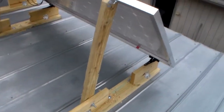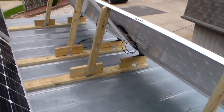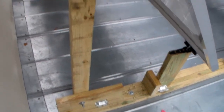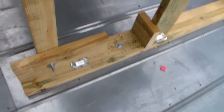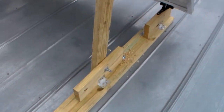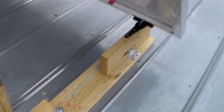I kind of like working with wood. I don't mind working with metal, but I thought I'd make these mounts out of wolmanized 2x6s and some 2x4s, and I think it worked out pretty good. I got them lag bolted with half-inch bolts down through the joists. Ain't going nowhere.